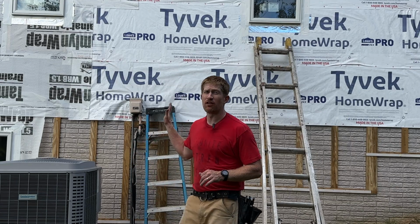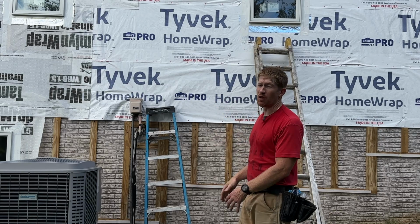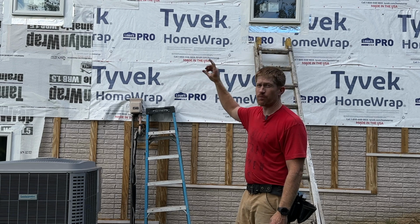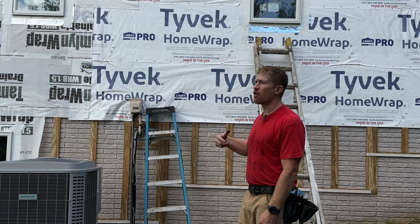As you've probably seen though, there's a lot more preparation that goes into it than the actual window install portion. Especially with these new construction ones with the nailing flange, those go awfully quick and taping them up is a cinch. So really the majority of my time is spent just kind of prepping the wall and getting things ready for that point.